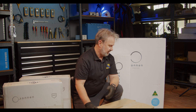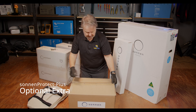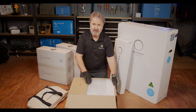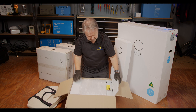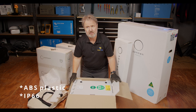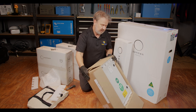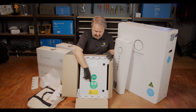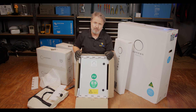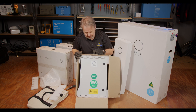Here we have the Sonnen Protect Plus. This unit gives you the ability to have backup with the Sonnen battery — the Sonnen battery 9.53 can be used as a solar inverter with battery and backup. It's a pre-built metal enclosure, pretty nice looking, fully labeled. You'll notice it's got the correct ES label with the UN number for the chemistry — the ES label is a requirement in AS/NZS 5139 and must be 100 millimetres in diameter. The PV label only has to be 70mm, so good to see them using the right labelling size.